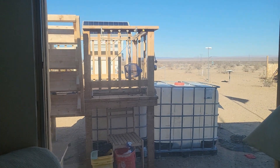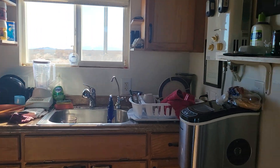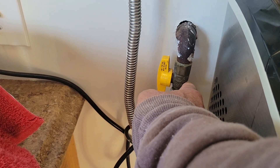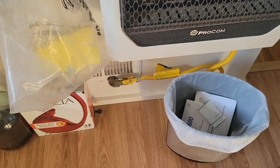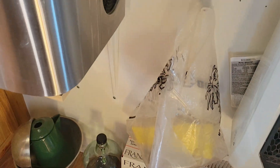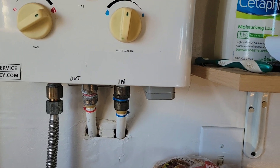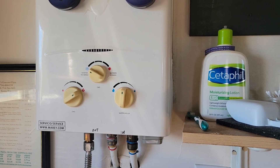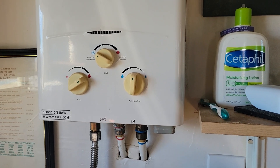One last thing: you do need a gas cock on the line. If you have a problem you can shut it off quickly right here and stop gas from going into the unit. Same thing on the wall — there's a gas cock down there too. That's all there is to it. I hope that helps. If you have any other questions let me know. This is G-Bear — thumbs up down there, subscribe and share. G-Bear signing off.